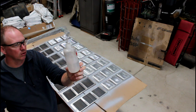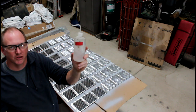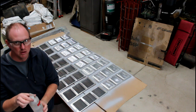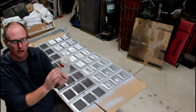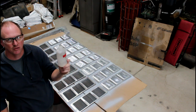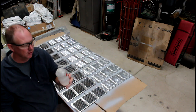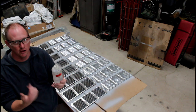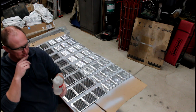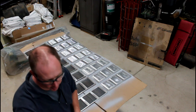I like these little squirt bottles for alcohol or acetone. One thing to note - with both alcohol and acetone, the product actually wears the label off fairly quickly. If you've got a hazardous material in a bottle, try to label it. I know which one's acetone and which one's denatured alcohol, but somebody else walking in here doesn't, so make sure you keep them labeled.